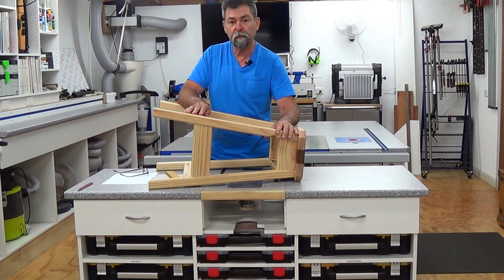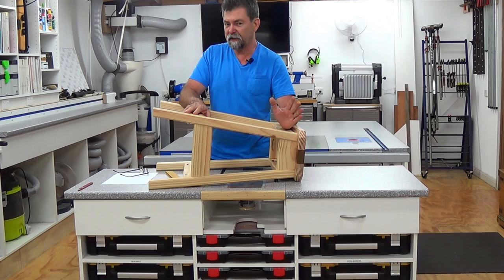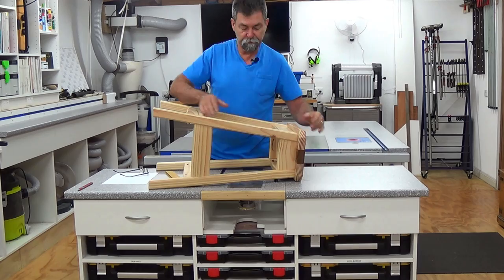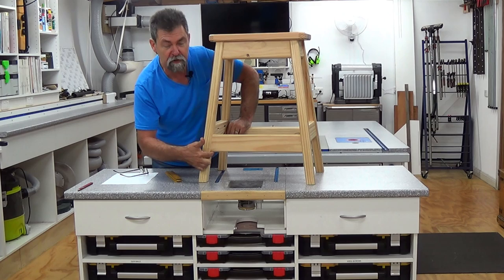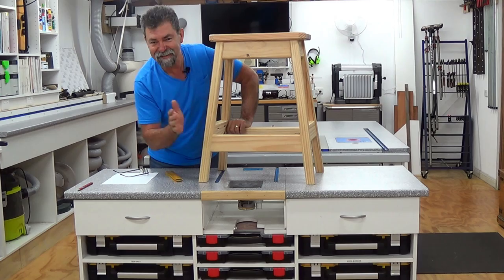Now they're going to have just straight out 7 degree cuts. You can see the whole thing is based around 7 degrees. So 7 degree cuts, and I'll show you up here. So this angle here, instead of being 90 degrees, is now, if I'm coming off this plane, it'll be 97. If I'm coming off this plane, it'll be 83 degrees. Look, it makes sense as you do it, so don't panic.